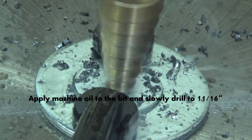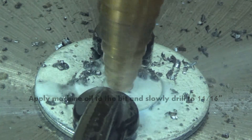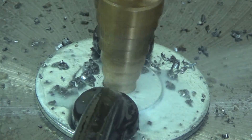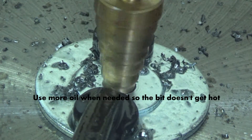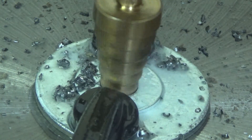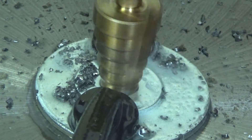Apply a little bit of drilling fluid to this. Slowly drill down with that step down bit, raising it up a couple times, and make sure you keep that drill bit lubricated — otherwise it can get too hot and it's going to send some flying shards at you. Just work that drill bit up and down like you see we're doing here.